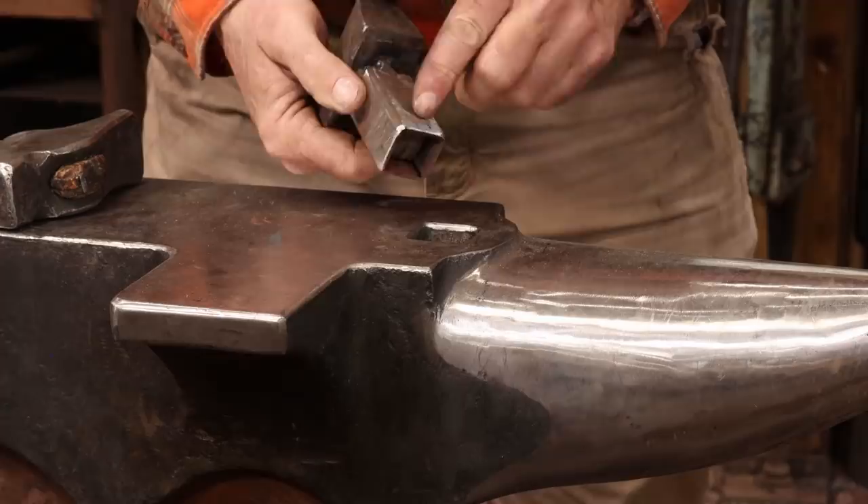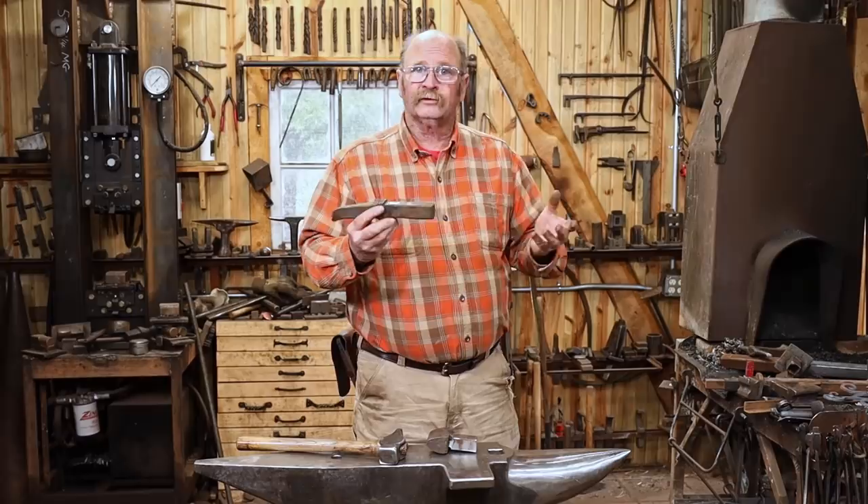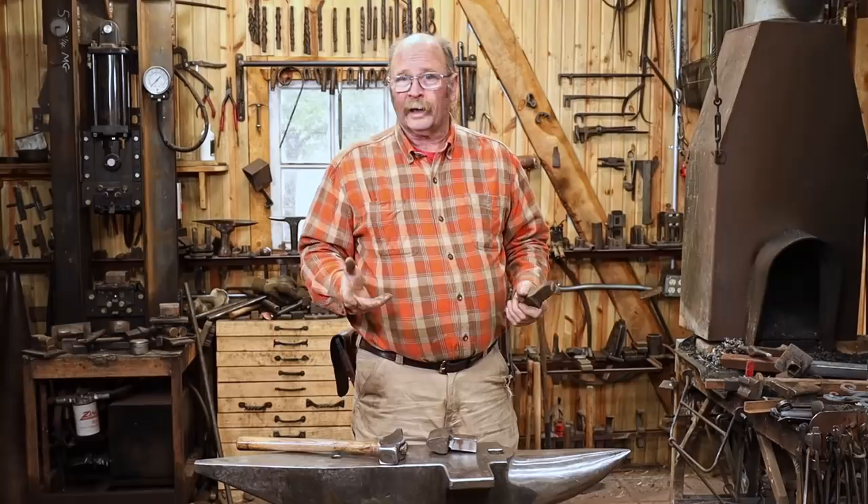On tools that are oversized and need to be reduced, an alternative to grinding is forging the shank down. If it's a tool that you made, you know what the steel is and the heat treat properties — you can get it hot, reforge it, then normalize, harden, temper, and put the tool back in service. It might still be faster to grind; it just depends on what you feel like doing. On fabricated tools that have welded-on hardy shanks, reforging often stresses the electric weld and causes a fracture, so on those I'd rather just grind them.